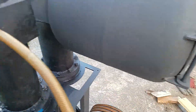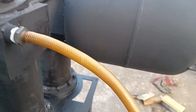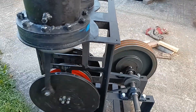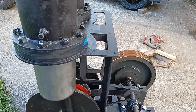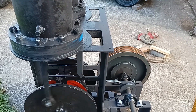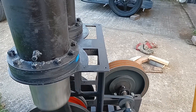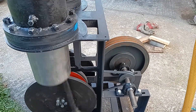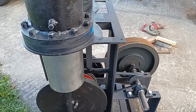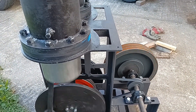Interesting — I've noticed this is a one-way valve here. Now if I put my hand over it the engine actually speeds up. Somebody mentioned this, give it a go. I don't know whether that means the engine's actually got too much compression, and by putting my hand over it it reduces the compression stroke. Very interesting. I'm glad it's actually running — that's a positive, because I'll be honest, the last few weeks I've been a little bit down thinking what to do. So I'm happy just to get the thing going for the moment.